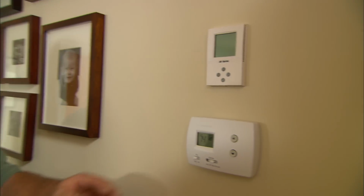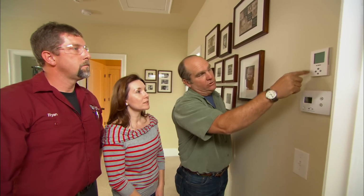So Cindy, down here is a device that everybody knows. It's a thermostat, senses temperature. Sure. Right above it is the new device called a humidistat. It's going to sense the humidity in the building. Okay. So you'll set it to the right level, and it'll bring on the humidifier, and it'll actually bring on the fan as well. Okay. So what level do we keep it at? I like to see 35 to 40%. I agree with that. Okay, but you'll get to know the right level.